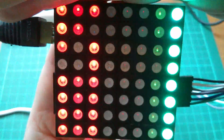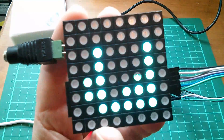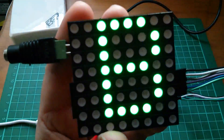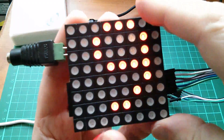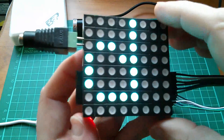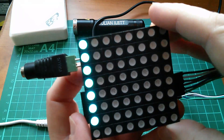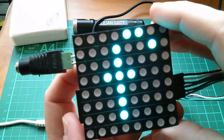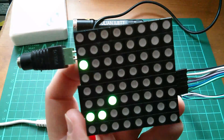Well now I'm getting recognizable characters passing through the display in all sorts of colors and patterns. What did I do? I turned the display 180 degrees — my pin 1 alignment was completely wrong. I suspect the constant-current driver protected anything from going disastrously wrong, but it seems the display was either fitted the wrong way around when it arrived, or I somehow got it wrong. Curious! But it's making a lot more sense now.